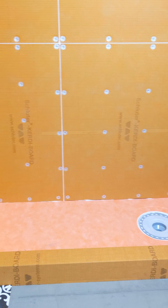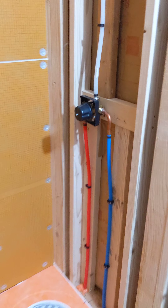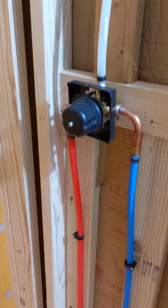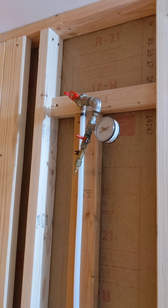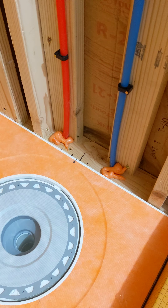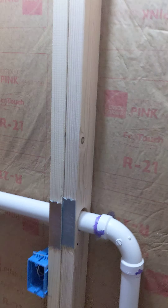Here's the shower — it's 60 inches long by about 30 inches wide. I'm using the waterproof orange backer board. 2-inch waste, and here's the hot and cold to the shower valve going up to the shower head. All the penetrations have fire block.